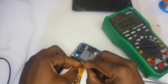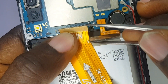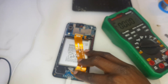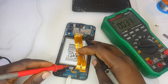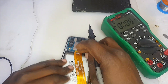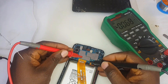Now that we've seen where the problem is — the VBUS line is conveying zero voltage onto the main board — we are going to scratch the VBUS line on the flex cable right there. We've scratched it. Now we are going to make a jumper from that point to the main board, but first let's confirm there's enough voltage on the flex where we just scratched.